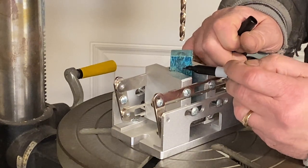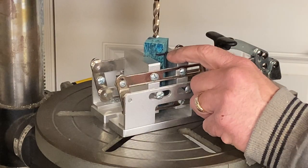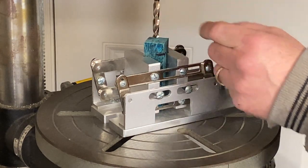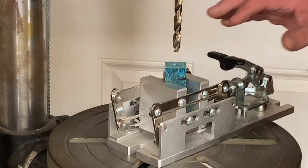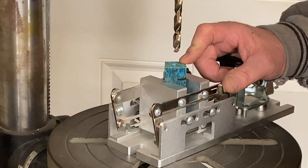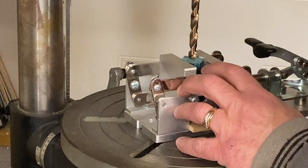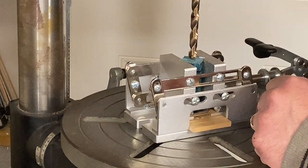This lets me know that this little black mark is set to the front of my vise. I've got my blank back in the vise, the registration mark is facing the front. We have a 5/16 inch bit chucked up, and we're going to drill 1.825 inches into our body blank. We're finally ready for the last hole to be drilled in the body blank — this is a 23/64 inch hole and we've got our bit marked at one inch. I've got the cap blank chucked up, and we need to drill 1.96 inches into this blank with a 3/8 inch bit.